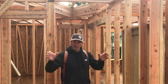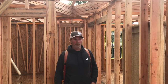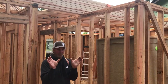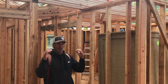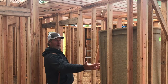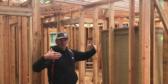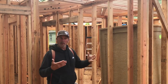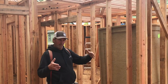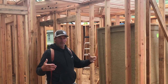So studs are in there so you can sheet them and replicate the stud layout in the wall below. Anyway, ideally I'd have both bundles set in position where you could break the bands and then scoot the gable truss off to the outside wall and nail it down, sheet, and that's to make sure it stays straight because there aren't any triangles in there to assure that it stays straight. I mean, for the most part, it's straight. It doesn't bend or bow a whole bunch, but that is a possibility.